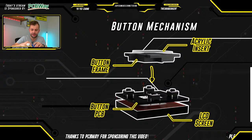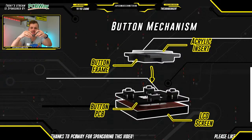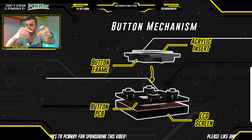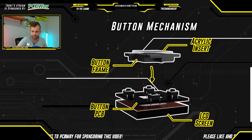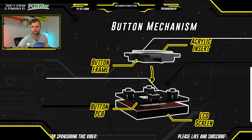so that no matter which of those buttons you push, you will register a button input. And then on top of that, we have this 3D printed frame with an acrylic insert, which you can buy online from several hobby vendors for really cheap, these acrylic squares. You press these in, and then these sit on top of the button PCB, and anytime you push the button, it registers as a button press. So a nice way to keep everything as easy and relatively inexpensive as possible, while still maintaining the core functionality of the DIY Stream Deck, which is of course being able to have an LCD screen underneath and being able to see the buttons.